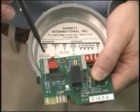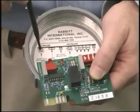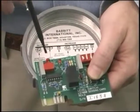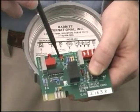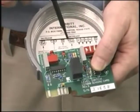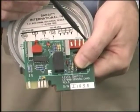This is the sensitivity adjustment. Our shorthand here means you turn it clockwise to increase the sensitivity of the unit. Next to that is an onboard test switch to test the circuit. The red LED tells you if the material is touching the probe, and this is what you watch when you're calibrating the unit. There's a time delay adjustment — again, you turn it clockwise to increase the time. A green LED over here is the relay status.